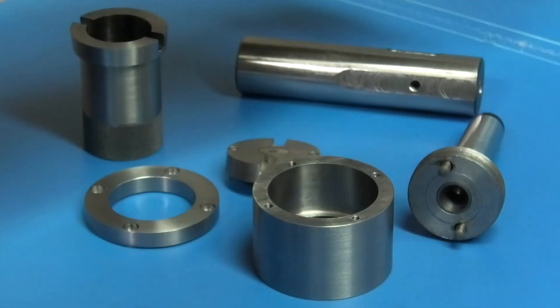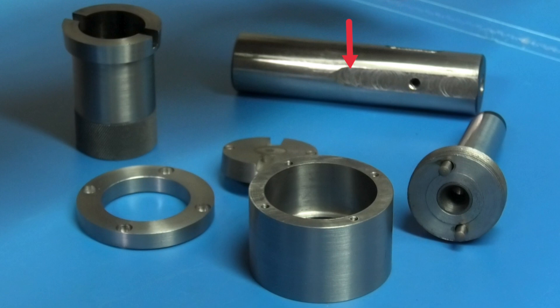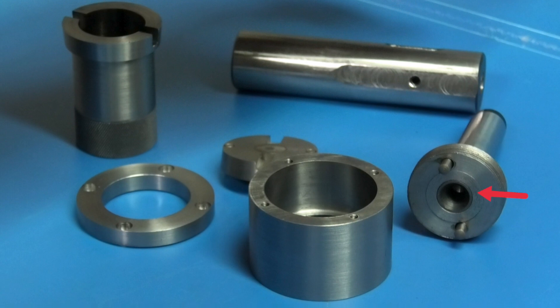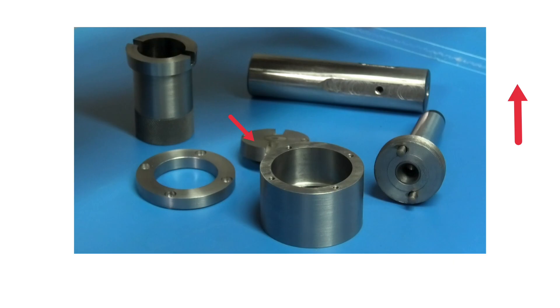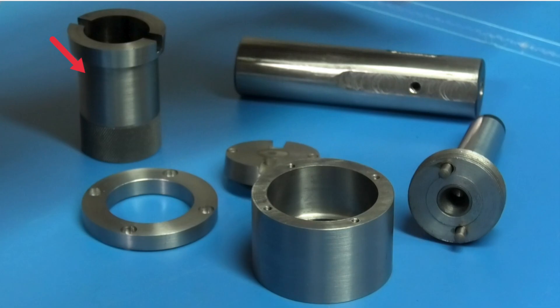Here are all the finished parts. You have the Morse taper sleeve, the Morse taper with the drive pins on, and inside there is a hardened steel bush with a centre drill 60 degree countersink. This is one of the first pieces we made with the thread in, that screws on this body with the two pins assembled. We have the cover, the pivot plate with the pins, a hardened steel bush which is flat to the surface, and the sleeve.